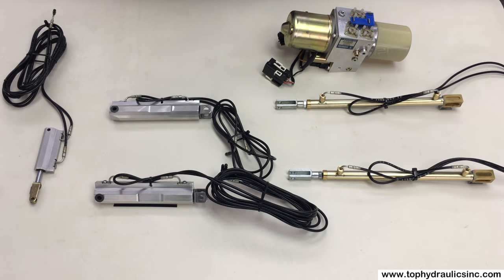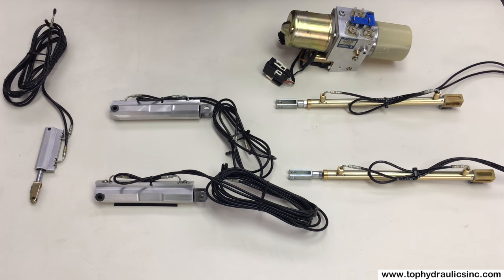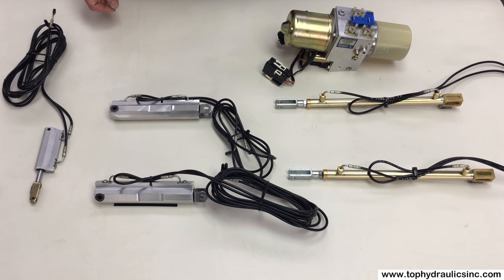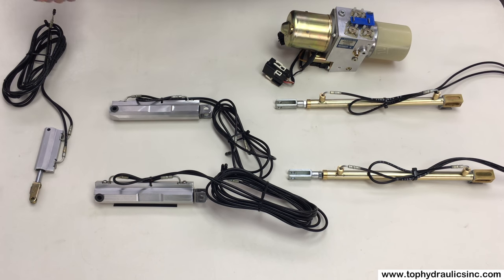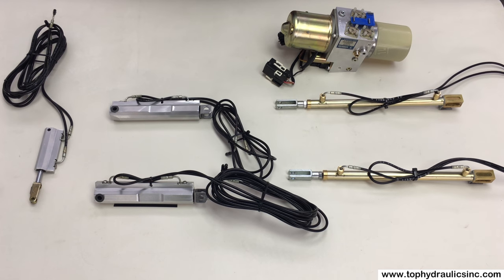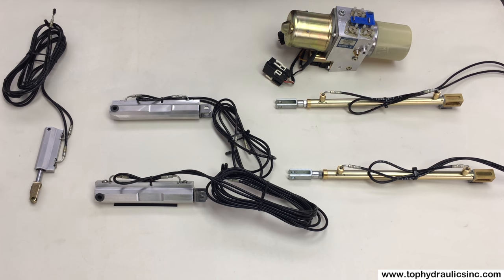What can go wrong with these hydraulic components? The most important issue is that you will eventually have bad seals in the cylinders and in the pump. The seals are by far the most important failure in these components. The manufacturer used materials for the seals that decay with time — they didn't use the best material possible. Top Hydraulics is changing that by putting in much longer lasting seals, for example made out of viton. Viton has an almost unlimited shelf life; it is a fluorinated elastomer that will not decay significantly with time and should be good for many, many decades.